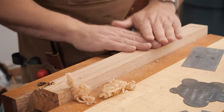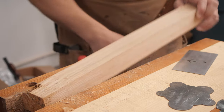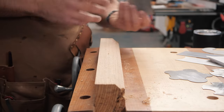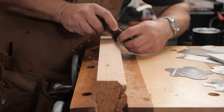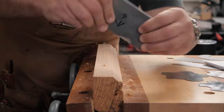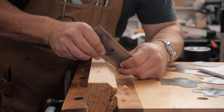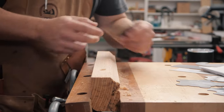Not only is it great for small pieces, but places where I'll use it without sandpaper are things like bevels and concaves. On something like a bevel or a mallet, you can hold it in one hand and pull towards you and just get a quick, nice finish. I usually don't bend too much — just nice and light. The bend keeps the corners from digging into your work, and I usually take a file and round those corners off anyway.